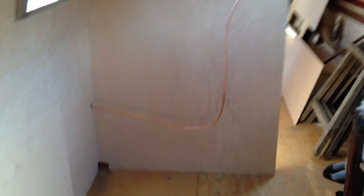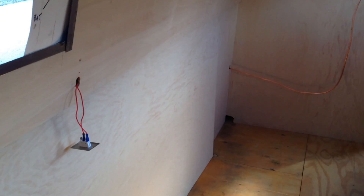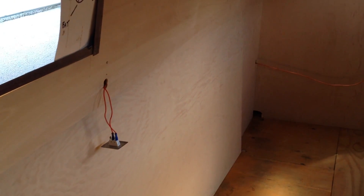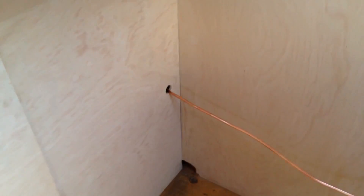I've got a gas pipe coming out here which goes into the side — that is going to be where the boiler is. I'm going to have a gas boiler for an on-demand hot water system. That was quite a big piece of plywood to cut to shape; there's a cut-out at the bottom corner for where the water pipe will come out, and then the kitchen area will be here. I still need to run another gas pipe down the other side, and I need to redo a plastic fitting that's in there — it's no good.